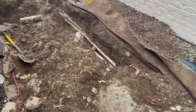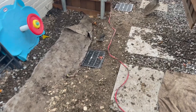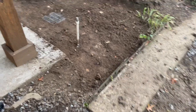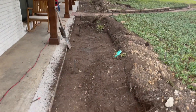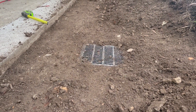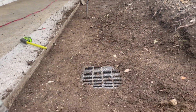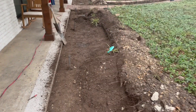We have just a little bit more work to do, but we've added the basins — it's really just a matter of putting this back. We got all of these installed, and you can see that the level is perfect, about three inches below grade. Then we'll put the river rock on top after our barrier fabric.